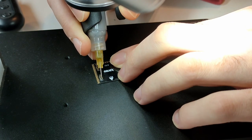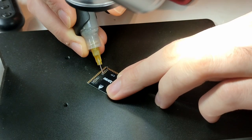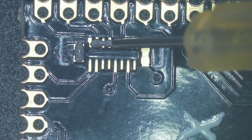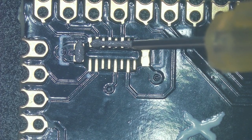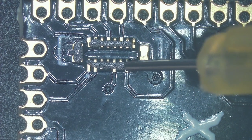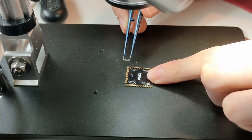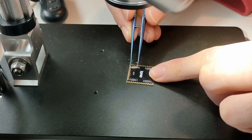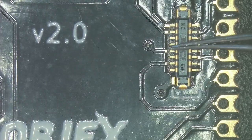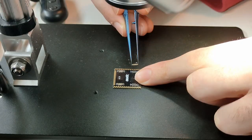So, first of all I put solder paste on the socket PCB and then I placed the SlimStack connectors. It may seem simple to do, but you need to have proper equipment. It might be tricky for people who have never soldered components this small. The SlimStack connectors I used are really very small and Objects Link is a very compact board compared to other similar products.